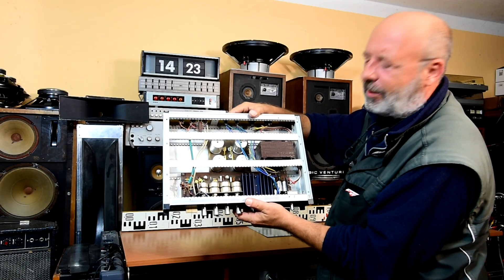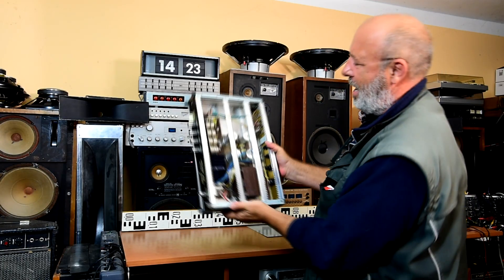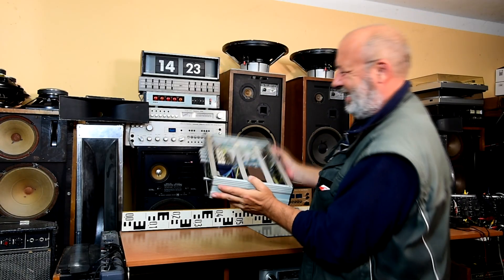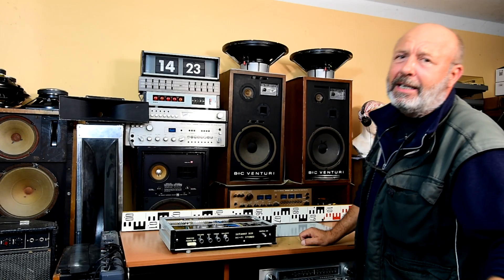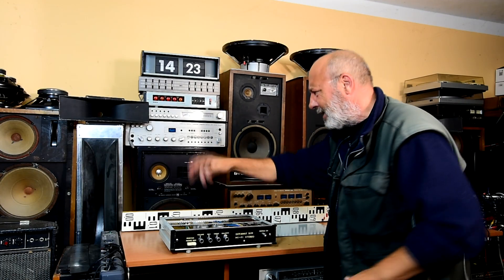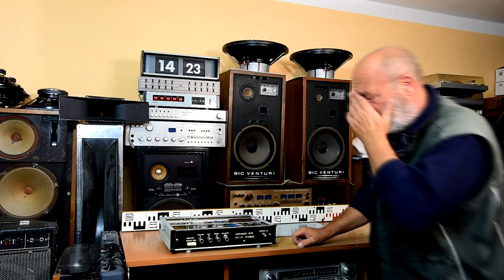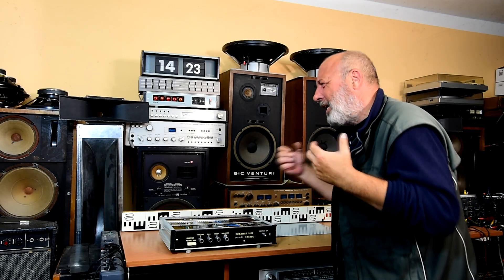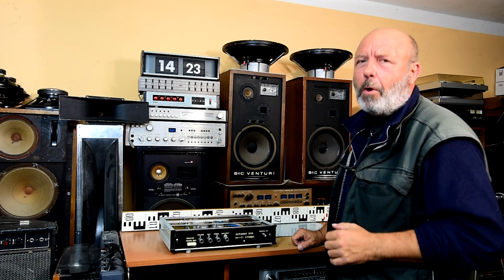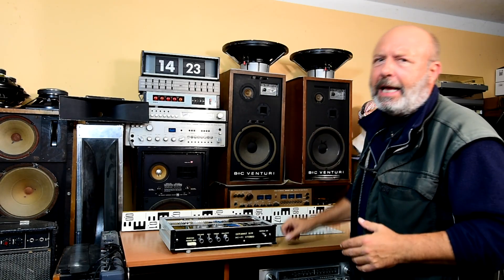See the detailed photos at the end of this video — it's incredible, incredibly nice, something like industrial, professional work, I must say. I like it. But this amplifier needs service. I tried about 10 minutes ago to connect it to the electricity. I connected the professional Dynacords, and when I switched the main switch on, I received from the speakers a brutally loud disturbing sound — the 50 Hertz hum from the electricity.